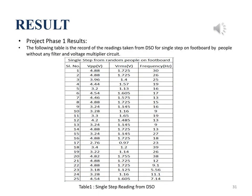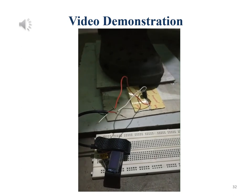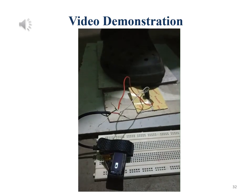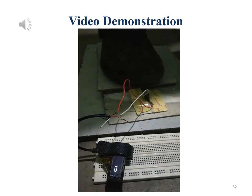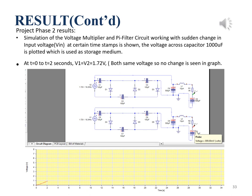This is the design of the charging system with user authentication module using Tinkercad software simulation. This is the result taken from project phase 1, where the table shows the DSO reading of a single step on the piezo sensor footboard. We took several readings, and here is a video demonstration of charging a smartwatch. In the simulation, we plot the voltage across the storage medium capacitor, comparing graphs of a constant voltage source and a varied voltage source at different time stamps. The constant voltage is taken as 1.725 volts based on generalized data from phase 1.